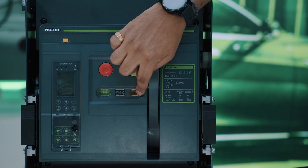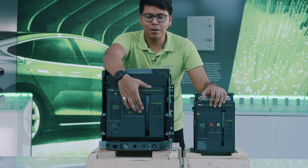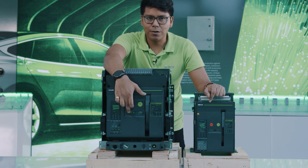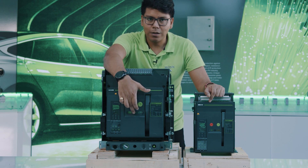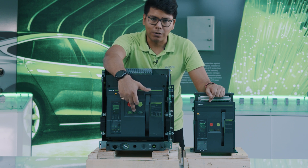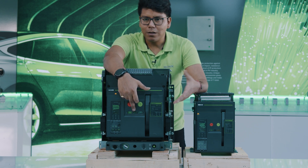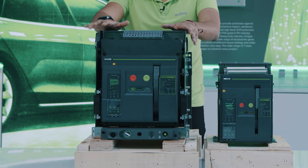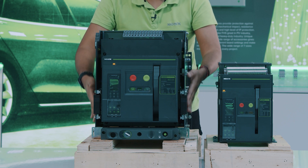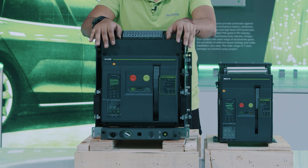As you can see, there are three small windows. As mentioned, in the A16 these show the status of the spring and the on/off status of the breaker. But there is an additional OK/not-OK window, which lets us know if the product is ready to switch on or not. This is related to mechanical interlocks, ATS systems, and UVT functions. Additionally, this withdrawable type also has the cassette, which lets us remove the ACB in the case of maintenance or a technical problem for replacement.